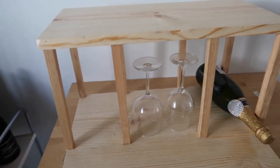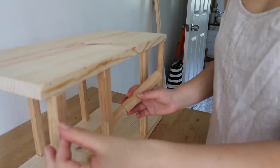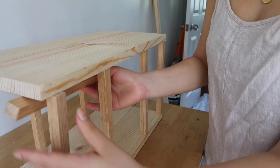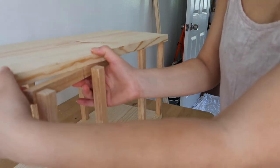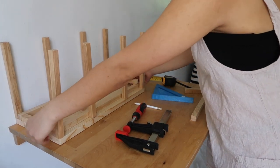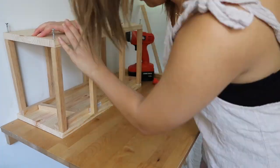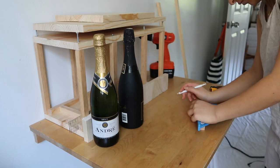This is a mock-up of it all flipped over — obviously the top wasn't attached, but the bottom sure was. The next day I got pieces of that one-by-one and put them behind, because I needed to find a way to connect the top to the tops of the dowels and keep the dowels sturdy. By putting it behind like that, I was able to drill up into the lid and also drill to the side into the pillars. Once I cut those pieces to size, the glue came back out to attach it to the base — obviously flipped over again — and it wasn't fitting properly because it wasn't at a 90-degree angle to start with, which we fixed up later.